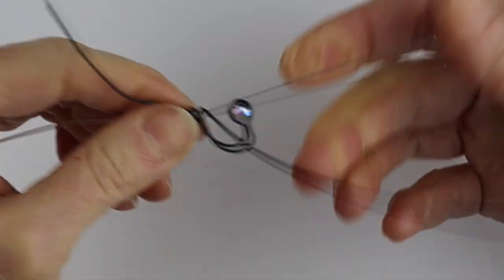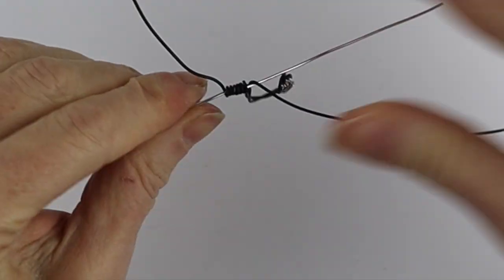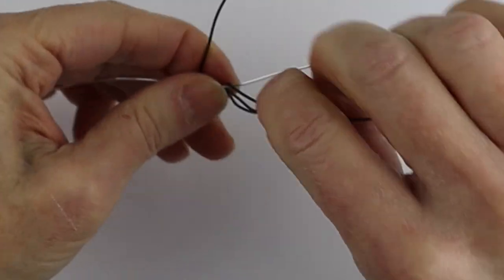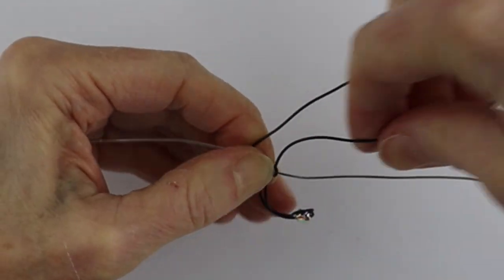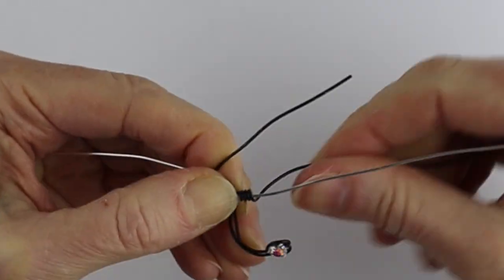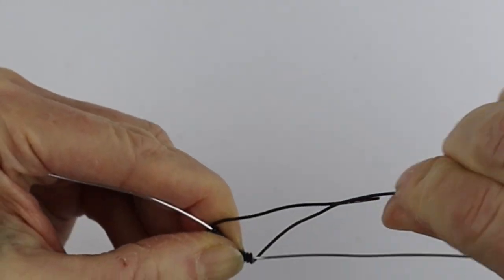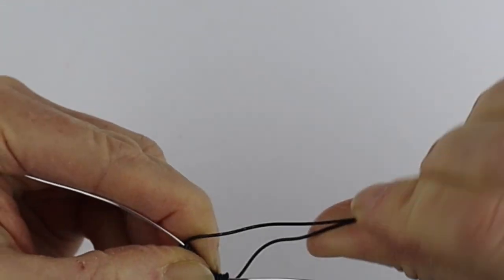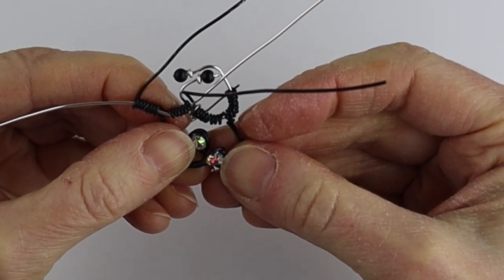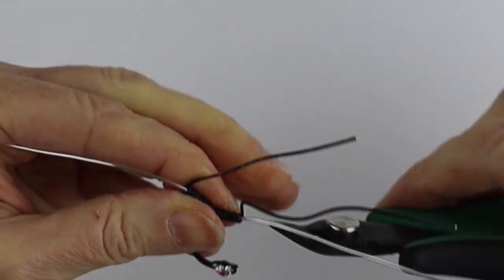If you find the wires are getting distorted, back it up, because you want these lines to stay lined up — that's the hard part. Then do the other side; if you have to bend the wire out of the way, it's fine, you can bend it back after. Wind this one around about seven or eight times: one, two, three, four, five, six, seven. Double-check it's about the same — do it about eight times so it matches — then clip that end.